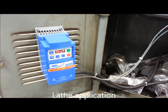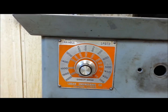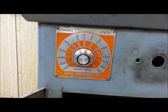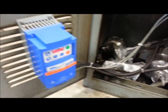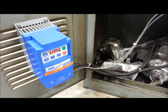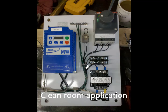Down here on the door of the lathe I use that one to variable-speed the lathe. You can see my old Reeves variable speed drive that I took out. I replaced the hand crank with a 10k speed pot for speed reference, and I have the needle calibrated to all the various speeds — makes a nice little plate. That's what I use to drive the lathe: two phases of input, three phases of output. I took off the single phase motor and put in a three phase unit.